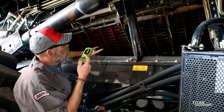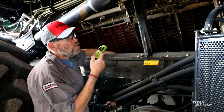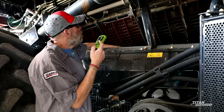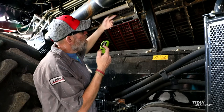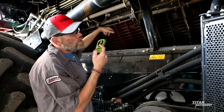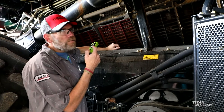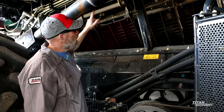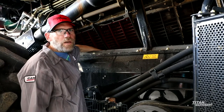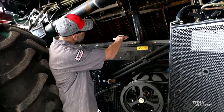Vane-wise, of course, just look up here and make sure all your vanes are still in here. On the right side of the machine there are actually two vanes over there — one that runs over the top and one that runs down the side. Make sure those two vanes are in here also. You have 10 on this side and the two on the other side. A lot of times if you have any kind of foreign material come in, it'll knock the two vanes out on the right side pretty much right away.